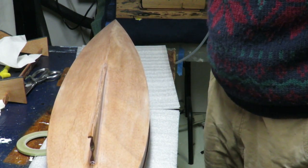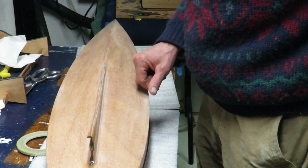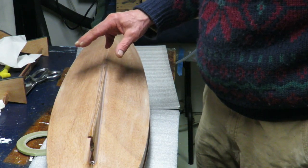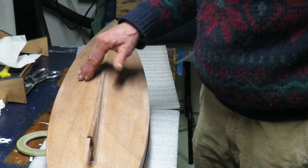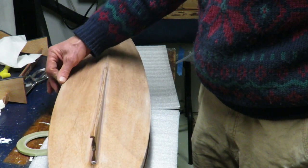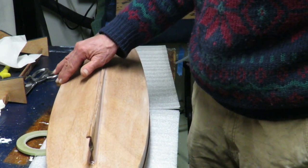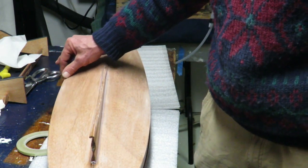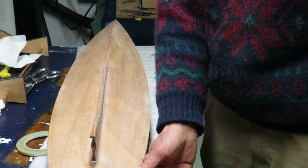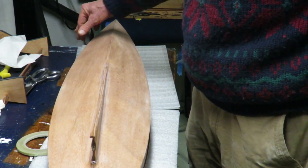And so we did the varnishing, and probably did a coat of varnish and then filled along the edges with the epoxy, but either can go first. And then we sanded the edges really smooth, so everything's totally flush. The way to tell is with your fingers. You can't see irregularities at this stage, though you'll see them under a gloss paint, but you can feel them. You can feel variations of less than a thousandth of an inch. So everything feels very, very smooth now.